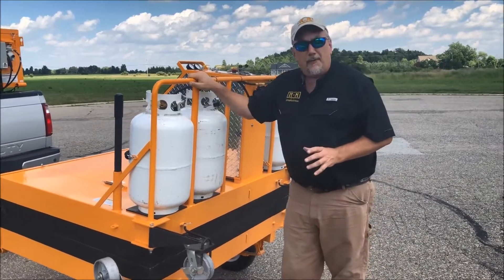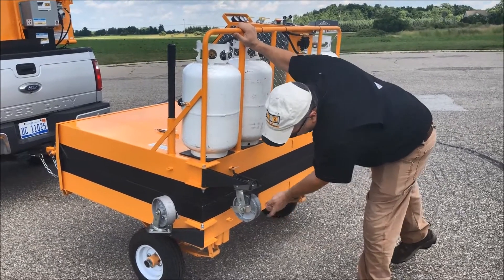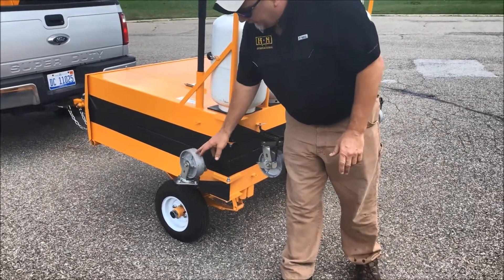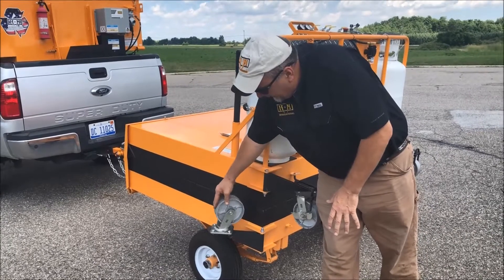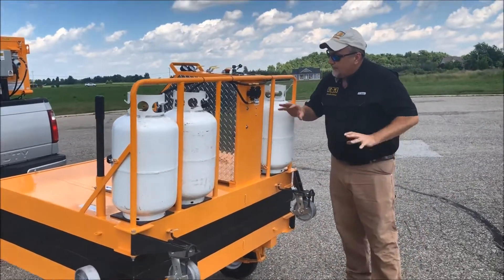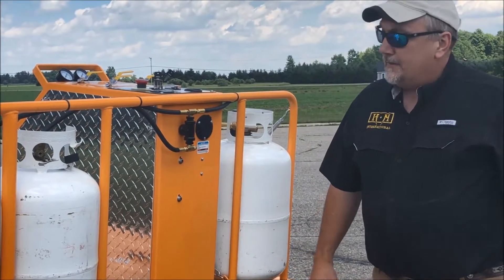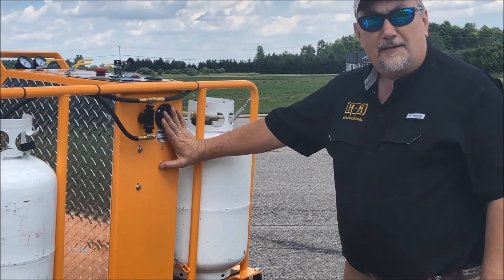The daily maintenance for your KM 440 or 448: every other day or so, depending on how often you're using it, you want to grease your casters. There is a greaser over here as well as this one right here and one here. The cleaner you keep your casters, the easier it is to maneuver on asphalt. If you ever have a buildup of asphalt on there, simply take a putty knife and scrape it off. You're producing 1800 degrees of heat, so you want to keep everything moving as freely and flowing as possible. The only other maintenance is to charge your battery — I can't stress enough to keep it plugged in. It will only take a charge when it needs a charge, so even in storage, just keep it plugged in. Thank you very much. If you have any questions, call 800-492-1757.